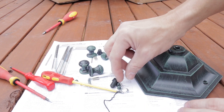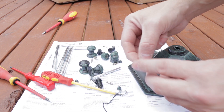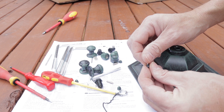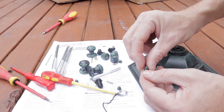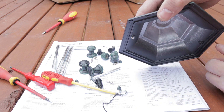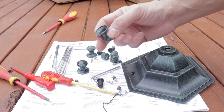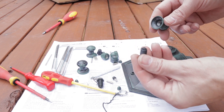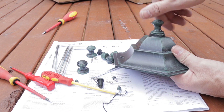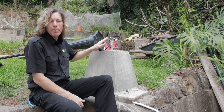The caps here basically just go on with these tiny little thread pieces. These thread pieces get screwed into the main light fitting and then these little nuts just sit over the top of them. You could put the nut in first — it's probably the easiest — then it goes through that little hole and into the light fitting itself. You've got to make sure it is long enough on the other side to actually fit into the light. Two per cap. Then they have these ornamental pieces that sit on top, and just a couple of plastic screws that go through the bottom, and that gets screwed onto the top. The lamp is now all put together and we're ready to mount it and wire it up.